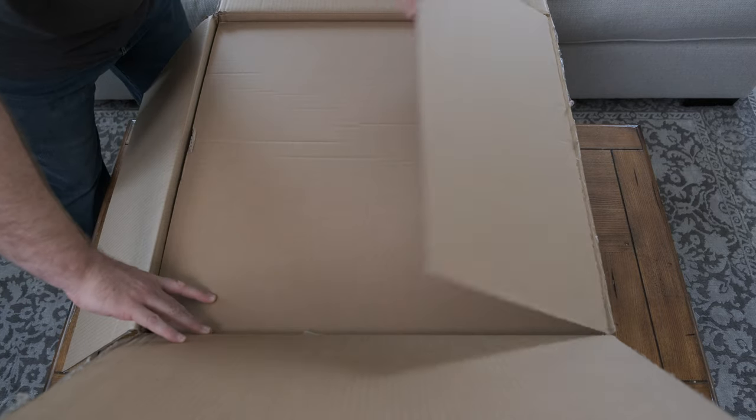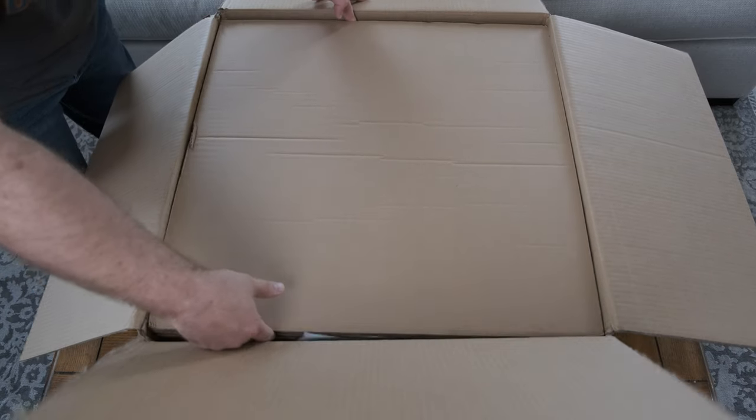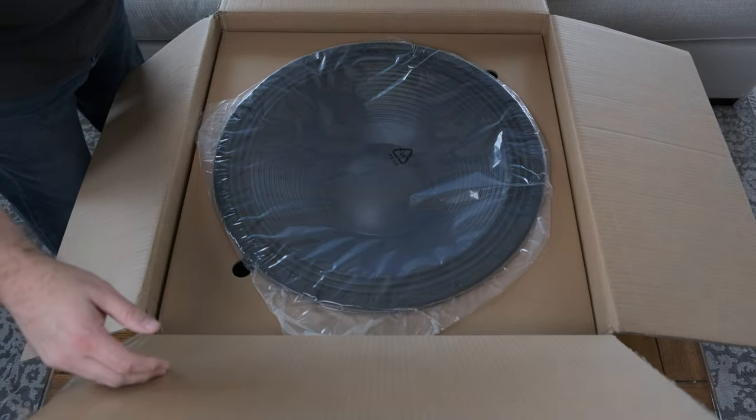Now, I've used this driver myself in a Marty Cube build, so I did the Roundover Marty Cube 21-inch pack from GSG Audio and used this driver, and I can attest to the fact that this thing puts out a ton of sound. It's loud. You can take an iNuke 6000 and drop on this guy, or take a 3000 and bridge it, or similar amplification, and it's going to put out a lot of sound for you.